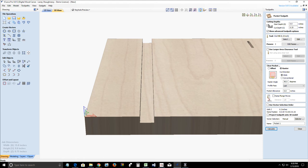Let's see here, but yeah, check it out. It's on the videos page, top row, the assembly videos at the very end. It's a step-by-step. And the only difference is, I think, Tad, you don't have the four-jaw chuck. You have the spur drive and the live center. So you don't need to round over your end of the stock.